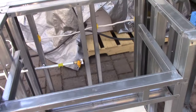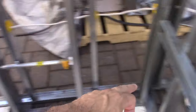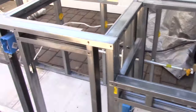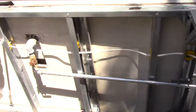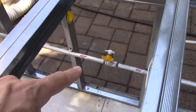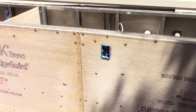I also reinforced a lot where the barbecue is going, measuring from there and taking into account the granite thickness. For the gas lines I put in valves — I have my central valve here which controls everything, then a valve for the burner, and I also put in a valve for the barbecue.